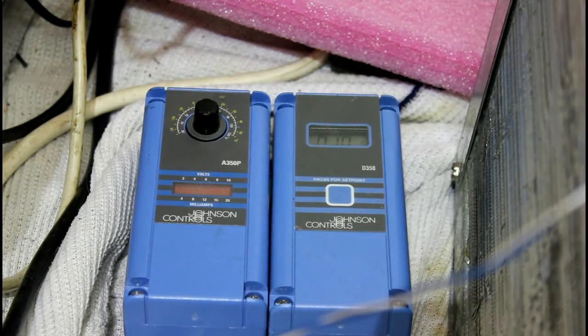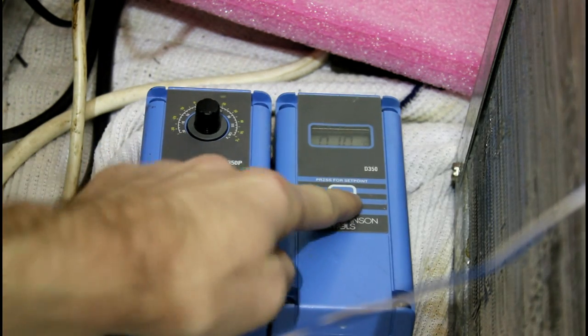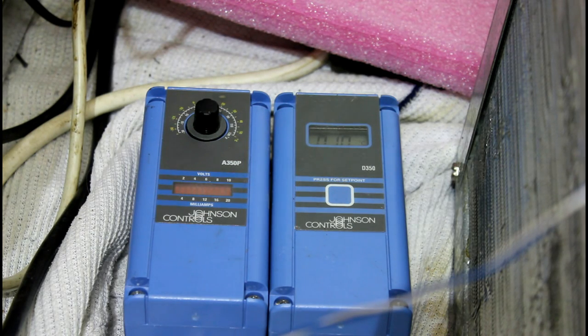Okay, now we have a temperature controller hooked up to our VFD, which runs the chiller's compressor. And right now it's currently satisfied, so it's not calling for any cooling. So the VFD is at its minimum output. But the water temperature is 10 Celsius, about 50 Fahrenheit. And the commanded temperature is 11 — so we're already below what we commanded.